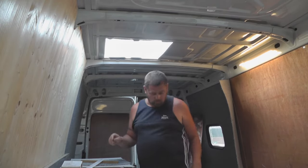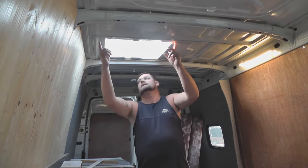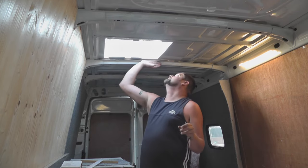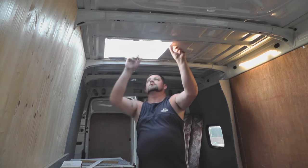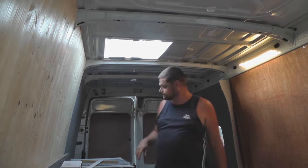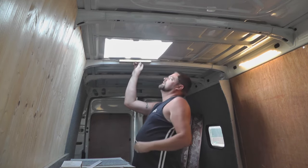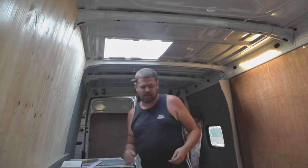Okay, now I've cut that hole. Apart from the tidy up job, here is where I want to put the battens. So one batten I'll screw into there, like so. And the other three I'll glue in. So the smaller batten that I've got will screw to there, like so. And then the other battens I'll put in with no nails.